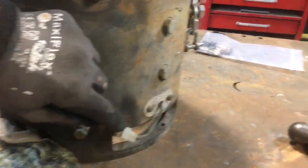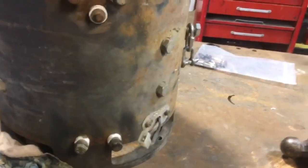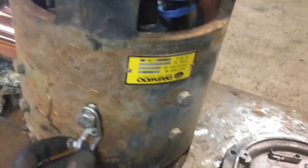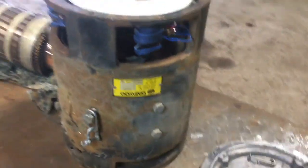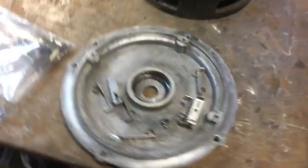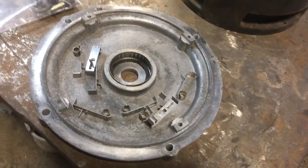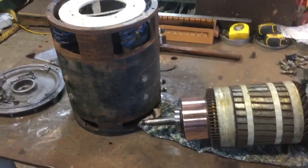There's also a thermocouple tucked into the case for a temperature sensor, and a plug I only noticed after getting it all apart — there's a dummy bolt that's actually a hoisting point, so having noticed it I might as well use it for the reinstall. Those are the brush springs, and now it's time to stick it all back together and put it back in the lift.